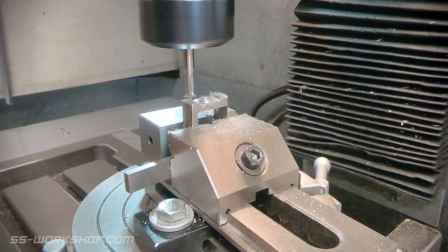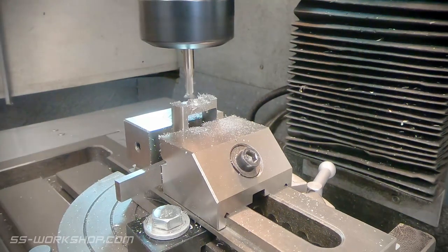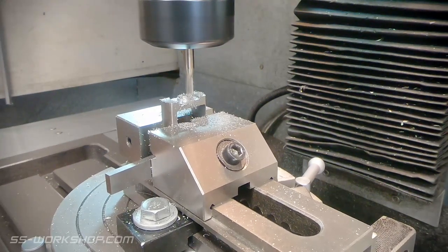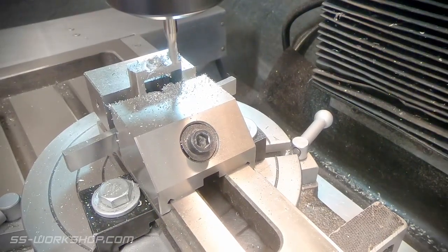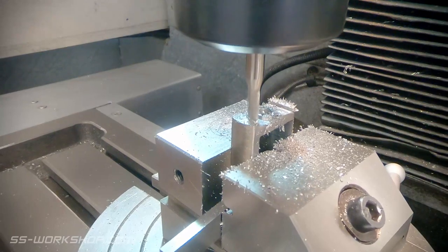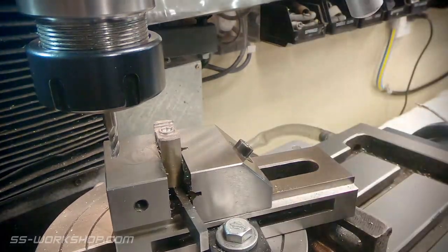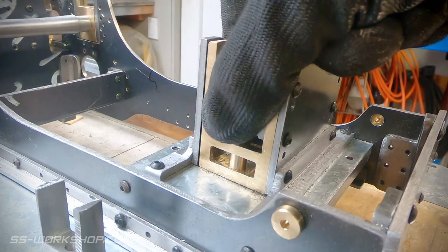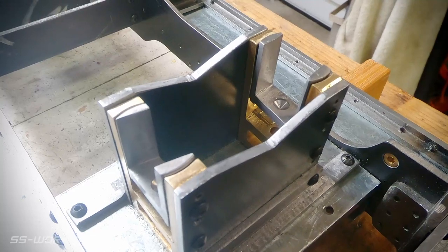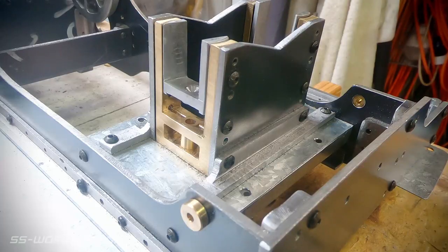With the circular feature cut, I've got a couple of square edges to cut, and we're almost there. The part can now be removed from the vise. Give it a quick clean up with a file and it's ready to go. It slips into place, and here you can see the two parts located in place. When you see these parts finished, it's pretty amazing that they can be machined with so little material remaining. But it all comes down to your process and thinking about work holding.